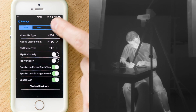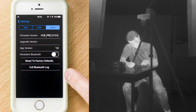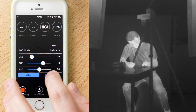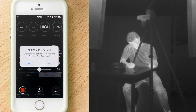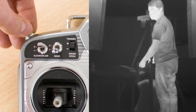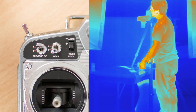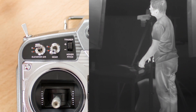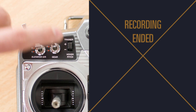In the about menu, the camera is running firmware 1.0.2, and the persistent Bluetooth option disables the Bluetooth sleep mode. The camera is currently in video mode; to switch to still images you click on still images and then reboot the camera — we won't do that now since we're recording. Here is my Spektrum DX7 radio transmitter: the top left 3-way switch is assigned to PWM 4 for color palettes, flipping through white hot, fusion, and arctic. The record start/stop is assigned to the gear switch — down for recording, top for stop.